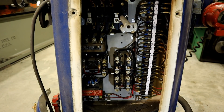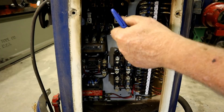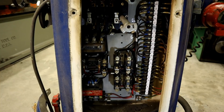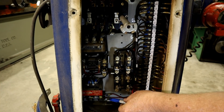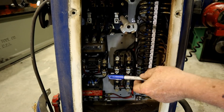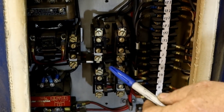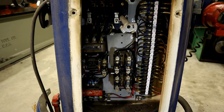Now we're going into the control panel where you have to change a few things. I love these old machines - everything's laid out nice and numbered, and most come with a blueprint, but sadly the blueprint's gone on this one. This is a switch that disconnects everything before you can remove the panel. Down here is another item to change: a transformer that can take either 220 or 440 input and steps it down to 110 to control all the contactors.